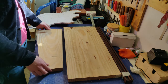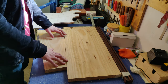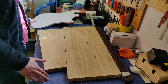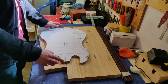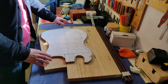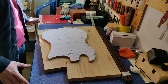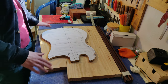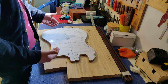I went over it with a straight edge and my router, but it's far from perfect — there's still a gap, so I need to flatten it out even more. This highlighted an issue: I've lost some material from flattening, and when I line up the midpoint of the guitar to the seam, I don't have enough material. An easy solution would be to move or rotate the pieces to avoid the knots. This wouldn't affect playability, just aesthetics — and it's kind of pushed me toward an idea I was already considering.